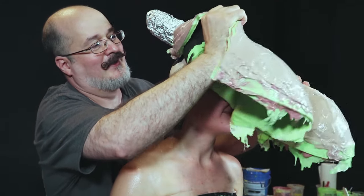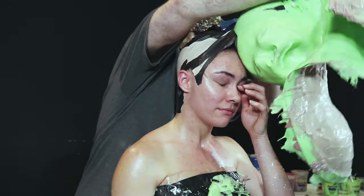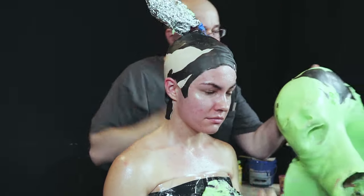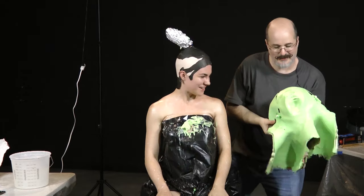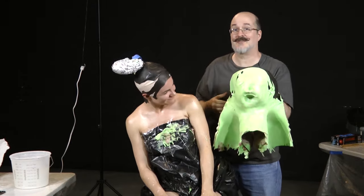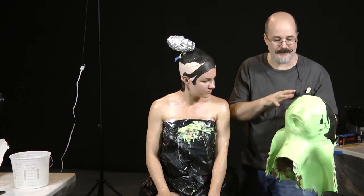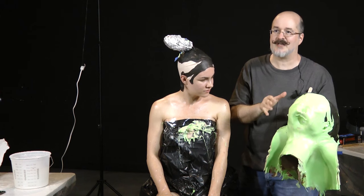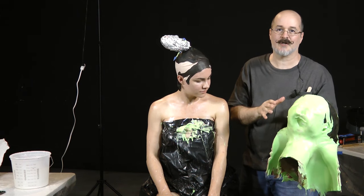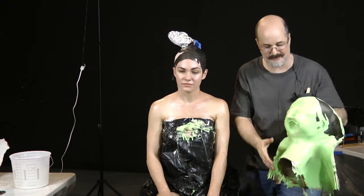Oh, there. Oh, nice. Oh, we got the alien. Okay, that's right. We got to show the alien face. This is alien. This is Savannah's face. A perfect copy. And we're gonna let this mold set up for another hour. Then we're gonna take some soap and water to it, wash it down, and then it'll be ready for casting.